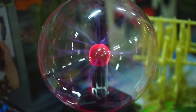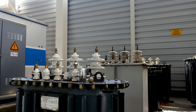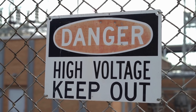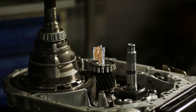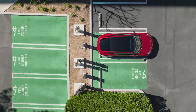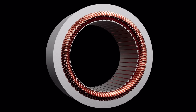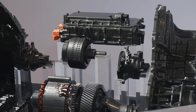Of course, no technology is perfect. Electrostatic motors face serious challenges. The first is voltage — these machines operate at extremely high voltages in the kilovolt range, which introduces major safety concerns and requires advanced insulation and specialized fluids. Then there's torque density: at smaller scales, these motors simply can't match the torque output of a traditional electromagnetic motor, meaning you won't see them in electric cars anytime soon. They also require entirely new manufacturing methods and supply chains — a radical shift that will take years, if not decades, to mature.